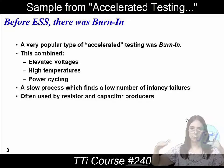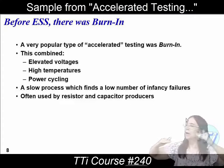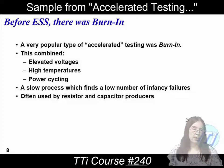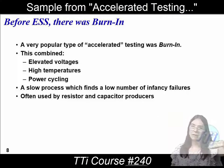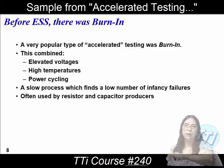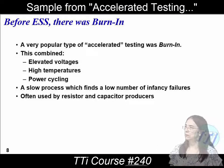You have to have some leeway. So if you pick a burn-in number, make sure it's actually providing a stress. Capacitors still need the burn-in process because they get hot during usage. But burn-in has lost favor because it's not really doing anything — you're just keeping it at a single temperature. Things become conditioned; they get used to that temperature. Cycling tends to bring out stresses more quickly. Burn-in is a slow process and finds a very low number of infancy failures. Most failures are found right in the beginning — that's the bathtub curve. We want to cut that curve off so these failures aren't going to the customer.